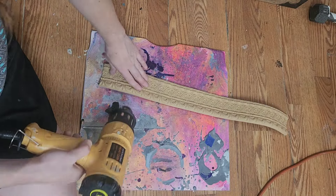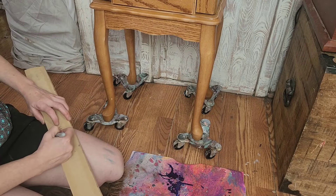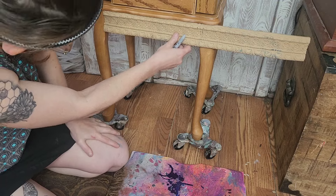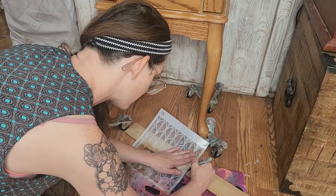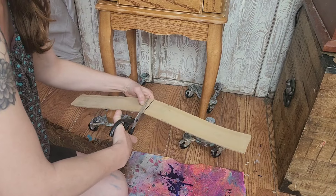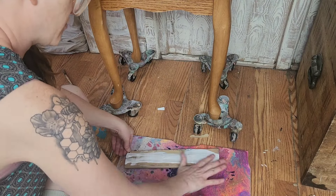Next up I'm going to measure and then cut this trim to fit on the bottom of this jewelry armoire. Remember to measure twice so you only have to cut once — as you may be able to tell, the first mark on my trim was completely incorrect. Once I had double checked to make sure my measurements were correct I marked a straight line, then I used a heat gun to warm this mold up and cut it with just a pair of kitchen scissors. I also like to sand any jagged edges smooth with a 220 grit sandpaper. I ended up cutting three pieces: one for the front and one on each side for the bottom of this jewelry armoire.